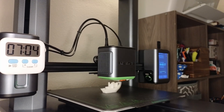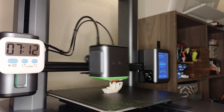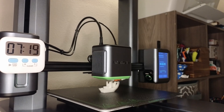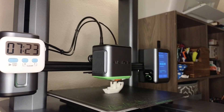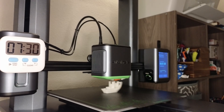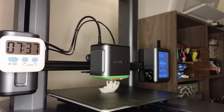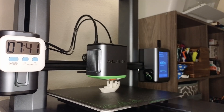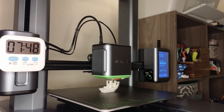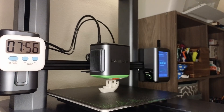What I don't love about this extruder system is there's a lot of backlash — a lot of gear backlash. There are also inefficient diagonal movements across there. I really wish we'd go four corners, but we're losing probably 10 or so seconds because of those inefficient travel moves. Maybe a little bit less than that, but it all adds up.